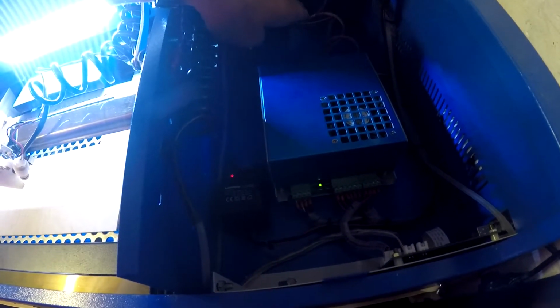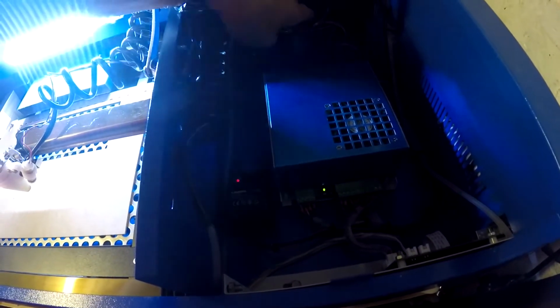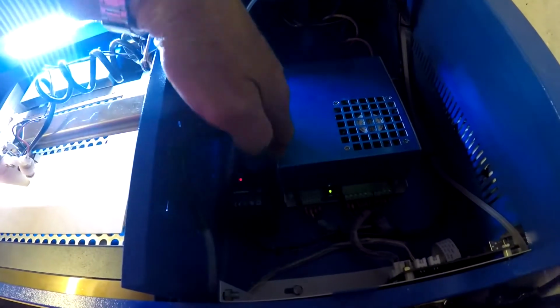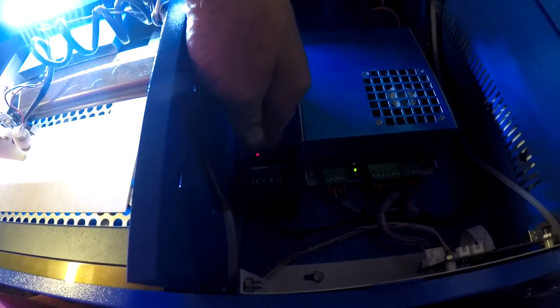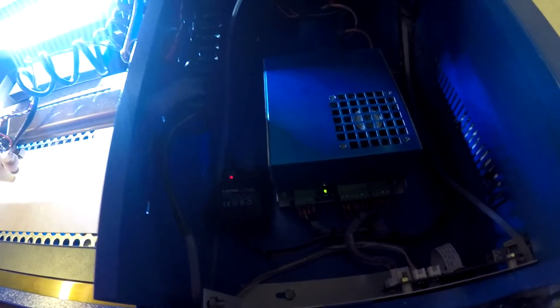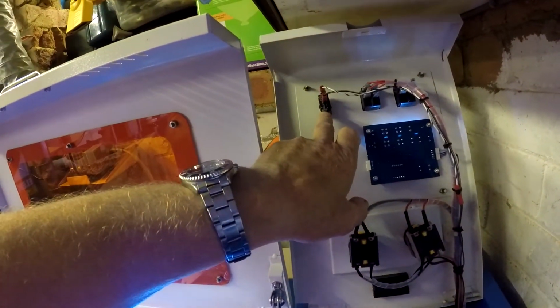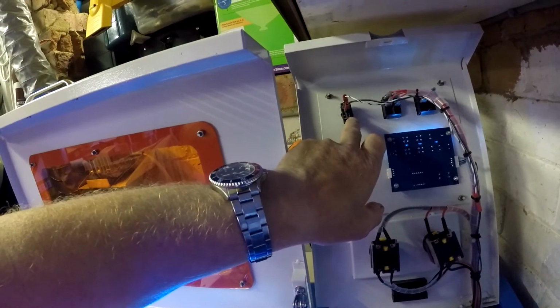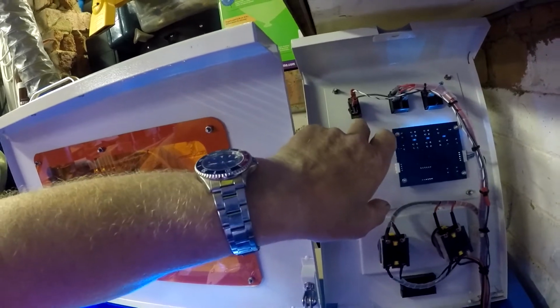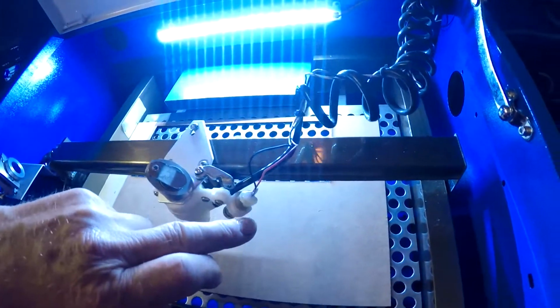It's been wired into the back of the input of the power supply for this, straight from the mains to this, and then the 4.5 volts which the variable power supply is set at comes from there, follows it right round, and all I've done is wire a switch in, which you saw on the panel earlier, and all I've done is switch the live. That's all I've done. So there's a break in the live, and that switches it on. It goes back down and along here to this laser pointer unit.